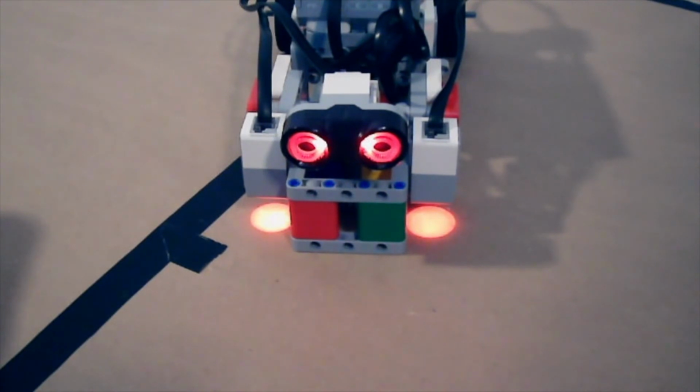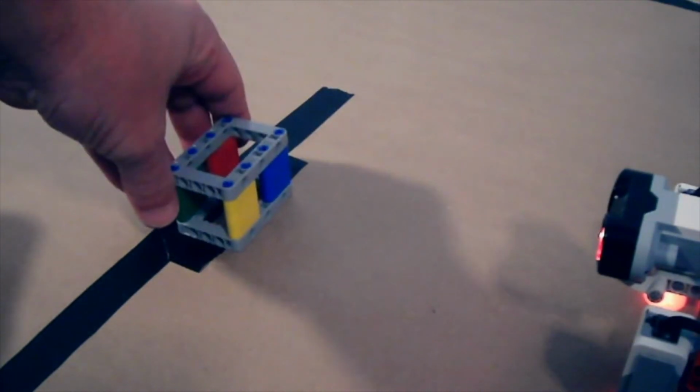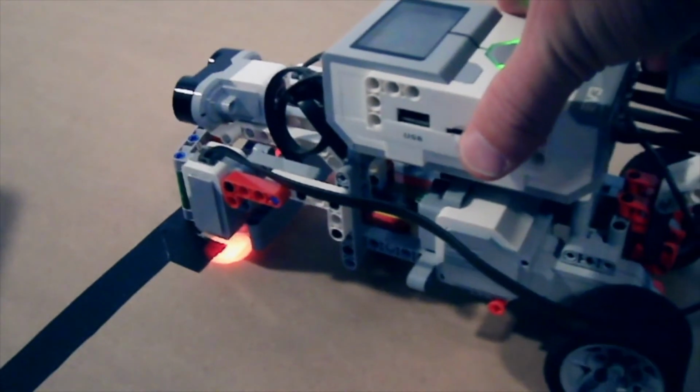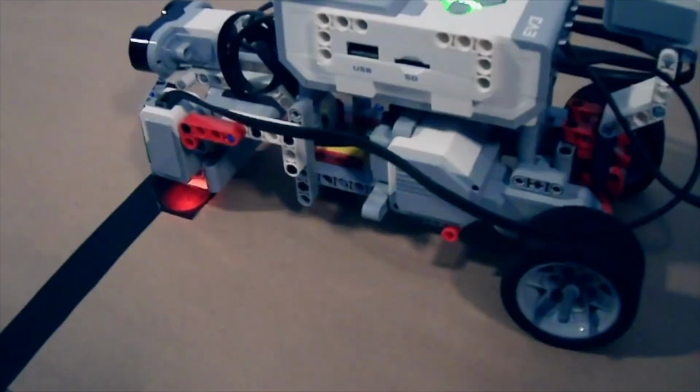So there's your task. I'm going to go ahead and work on my code. And what I'm thinking here is I want to be able to pick up this cuboid, or not pick it up, but to grab it. And once both of my color sensors detect black, then I'm going to kick into my next code, which is going to be to continue to go waiting until I see black, or to drive this distance of 33 inches, which we have done in a previous lesson as well, to get to the second black line, which is over here. So I'm going to be working, I'll show you my code here in a little bit, working to grab the cuboid so I can push it and stop at this second black line.